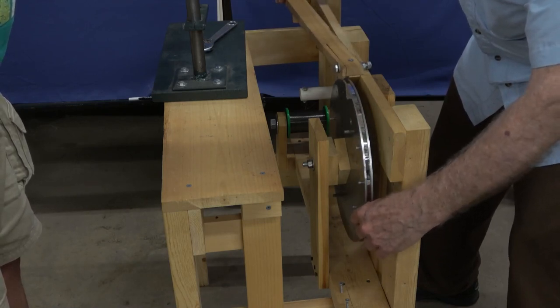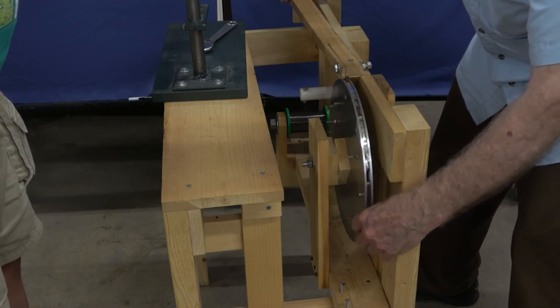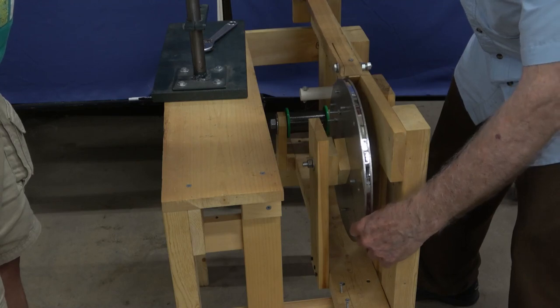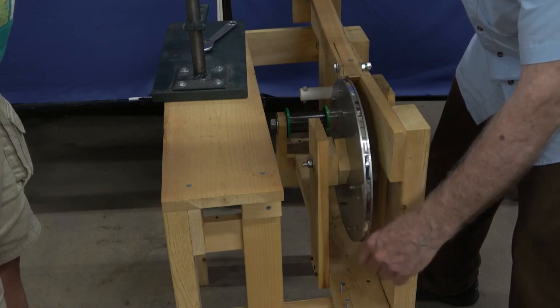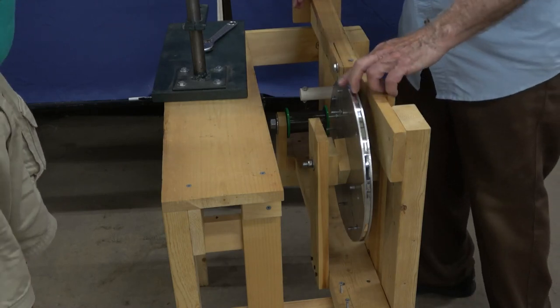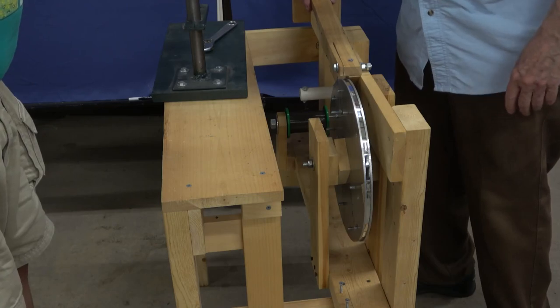The idea is to start on one side and slowly wind the wires side by side. You go slowly across, moving it across this way. Depending on the size of the wire, it's in the vicinity of 50 to 60 turns of the mandrel on it.